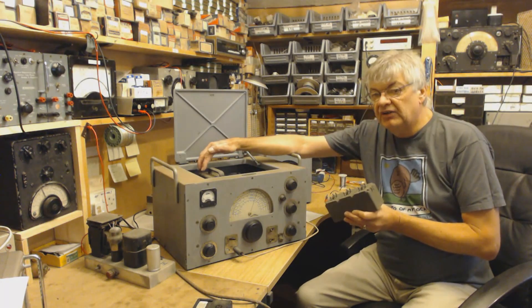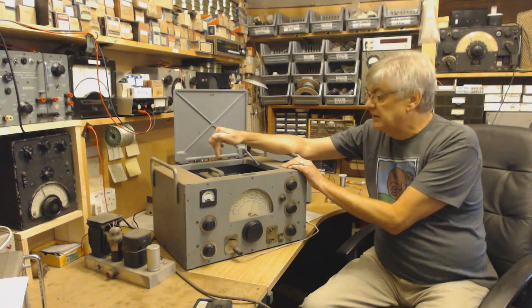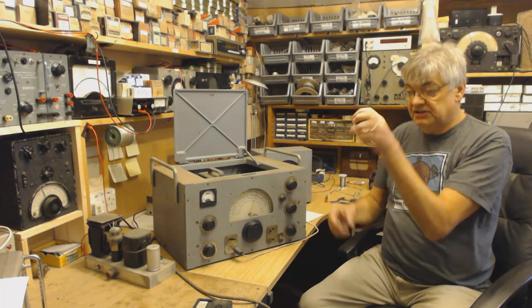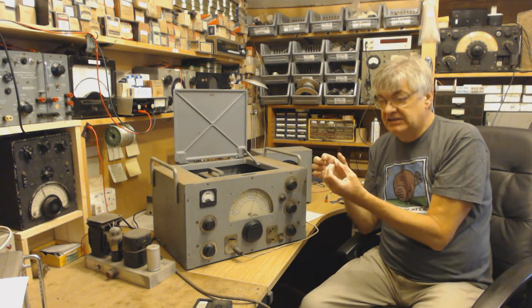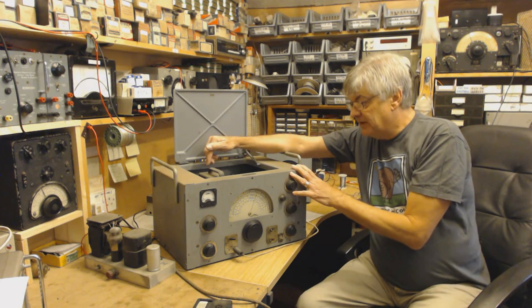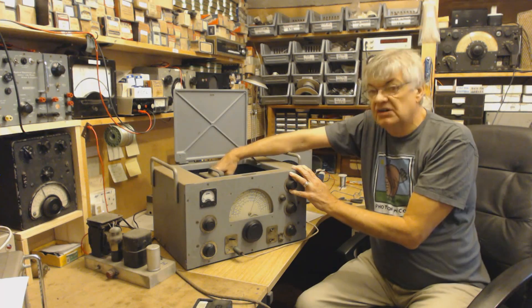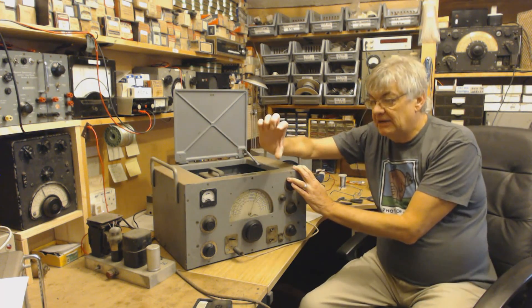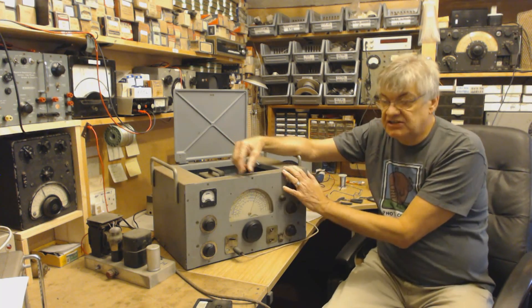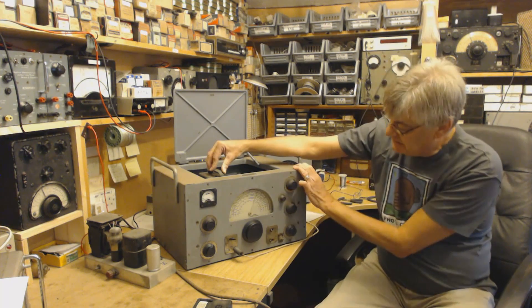What we used to do on the CR100 - the RF amplifier - take out the octal valve which was the RF amp. I think in this case it was an EF39, I read somewhere. Then mount a little B9A valve base, get an octal valve, break the glass off so you end up with just the octal plug, and mount a B9A valve base on that, wired through to the correct pins. On the CR100 we used an EF183 or EF184 - something like that. You don't need to do any modifications to the circuit at all. I made up this little contraption, put my EF184 in it. I had the Marconi on shortwave listening to a station, took the octal valve out, put my EF184 in - and what a difference. RF gain, what a difference. Signals came right up. So that was worth doing.